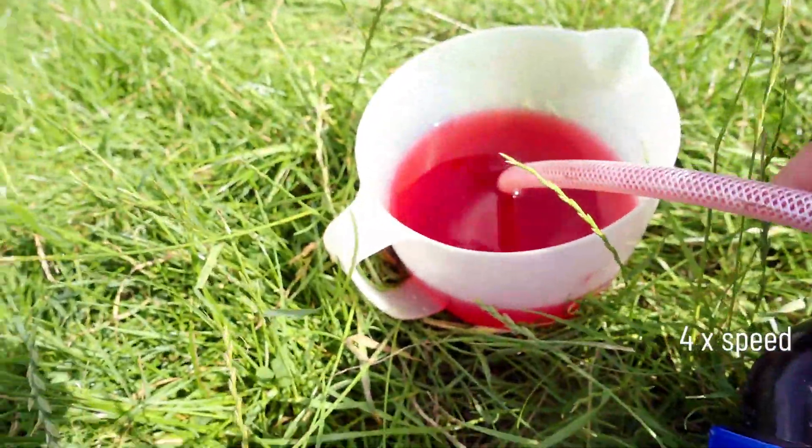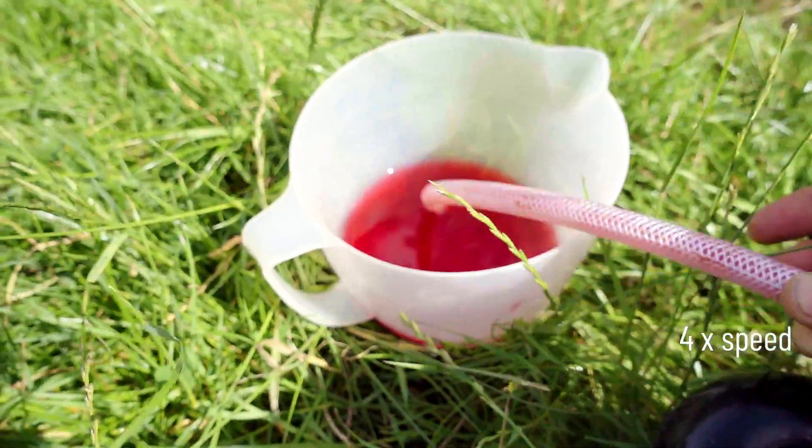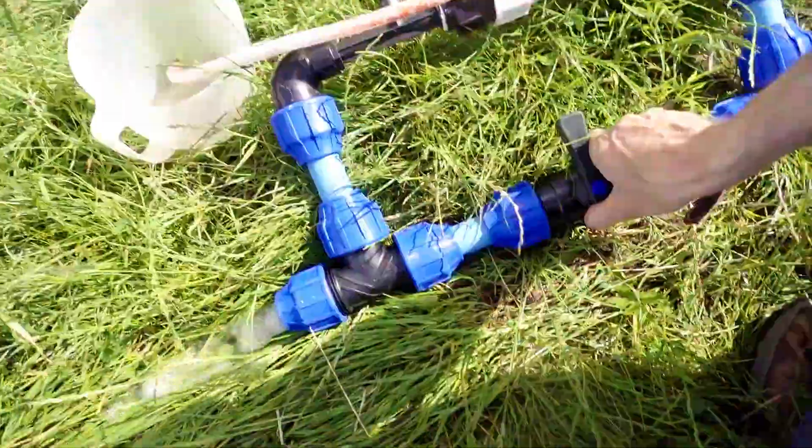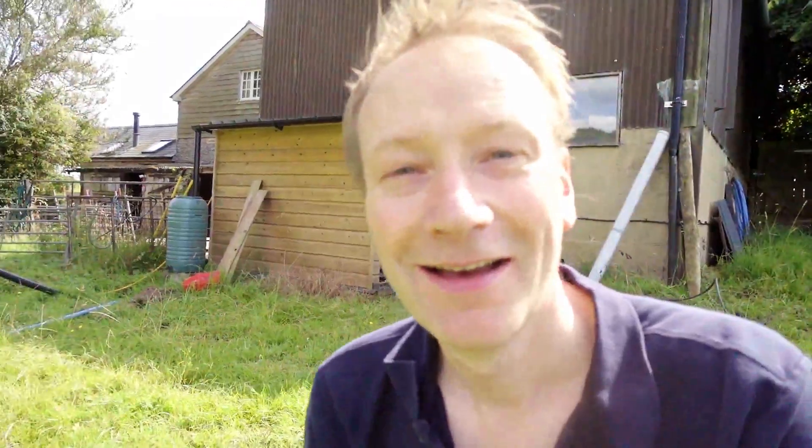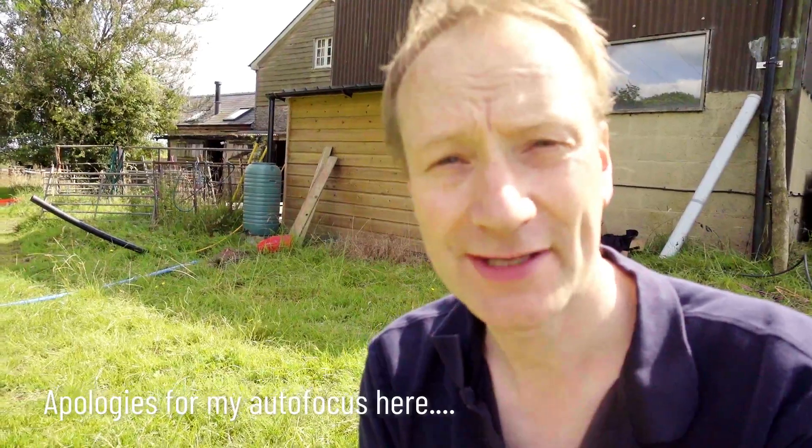It's definitely going down. That's fantastic, I really enjoyed that. Now all the liquid's gone through I can turn this back and resume normal flow. The results show it was taking 45 seconds to do 2 litres through the venturi — that's roughly 180 litres per hour. So I can make the fertiliser as concentrated as I like, add it to say 100 litres of water, send it through to a section of the vineyard, and it'll take about 40 minutes.